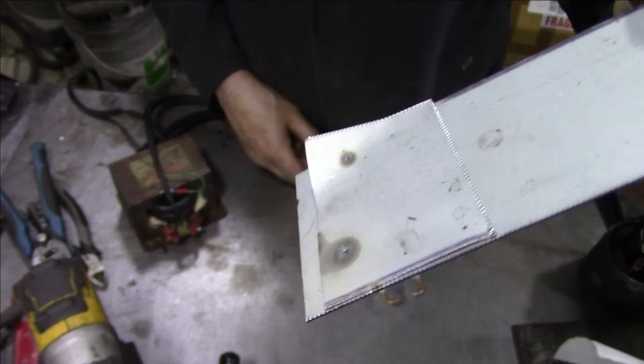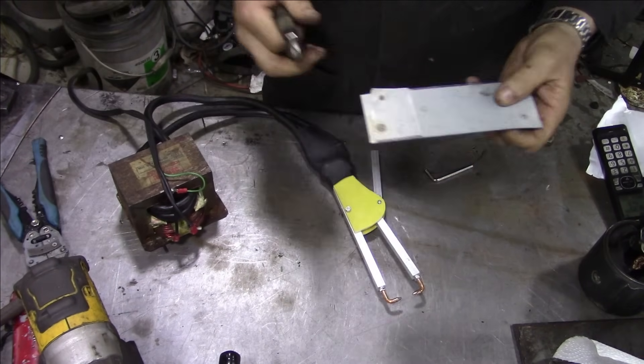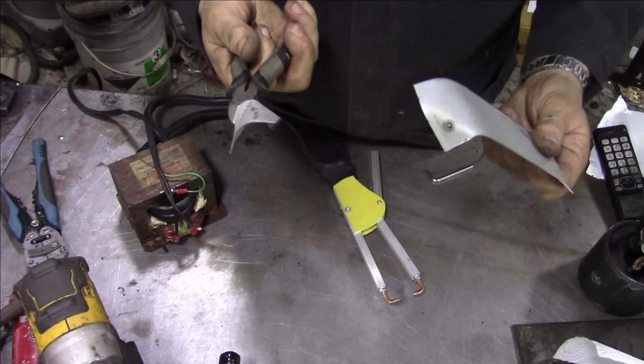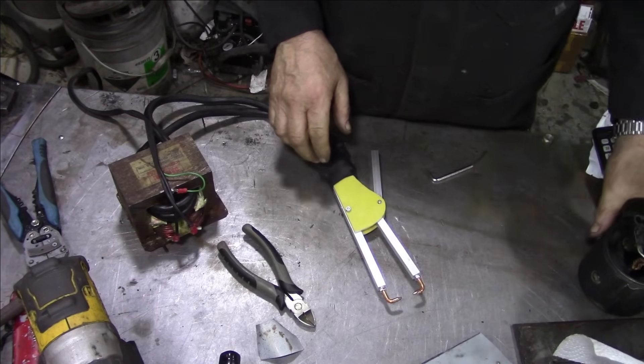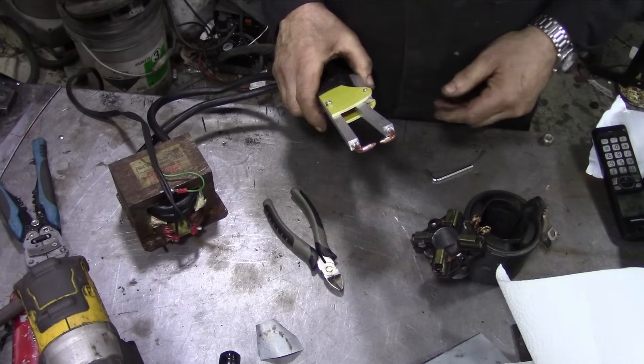Watch this - are you ready? There - that's all we want. We're not going to weld a ship up, but that's not bad. By varying the timing we'll get something quite good. I've got to play around with it, but all it needs to do is hold some brushes on. You could break individual ones off that tin, but if you put about five or six spot welds in, let's see how strong that is.